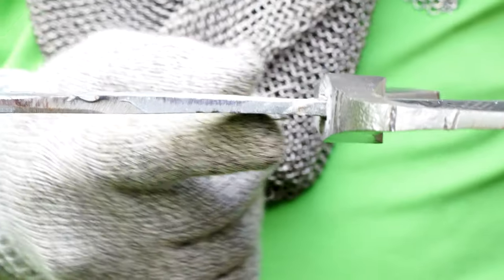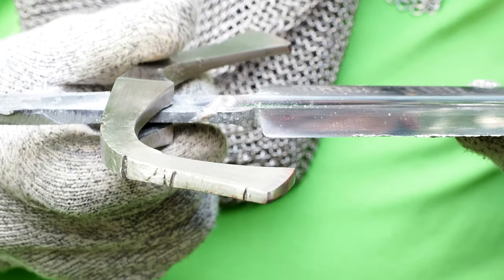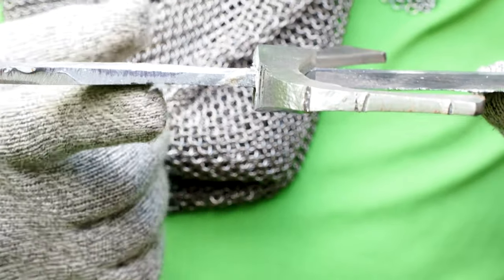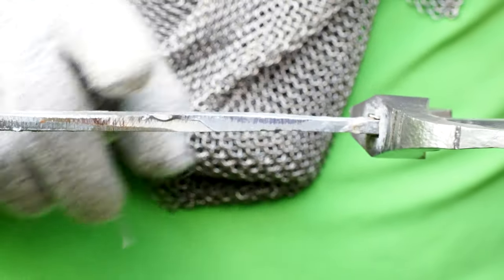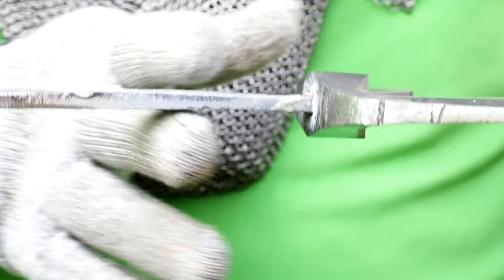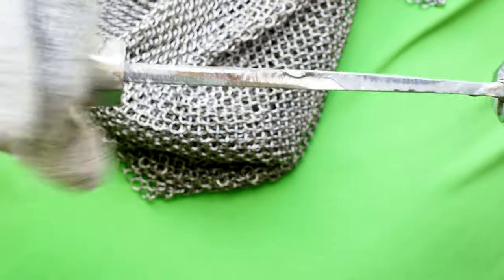Alright, so you can almost see how the tang is thinner right near where the cross is, a little beneath it. Where the cross is, it thickens out right where your hand is, usually where the node is on the sword, or on the grip, the vibration node somewhere in here. It's usually where they end up. It thins out and then it gets thicker, and it tapers the other way here. It's pretty thick towards the pommel area.